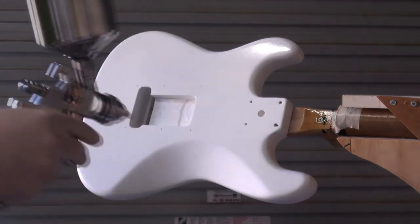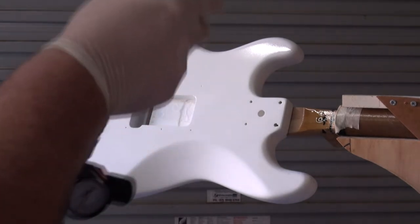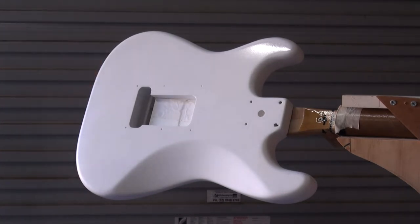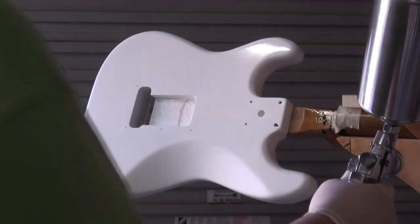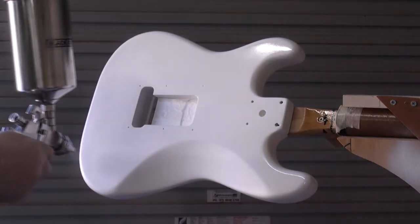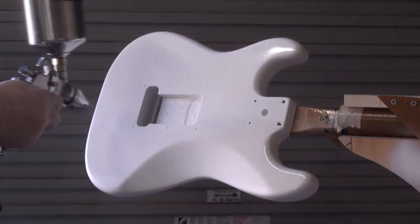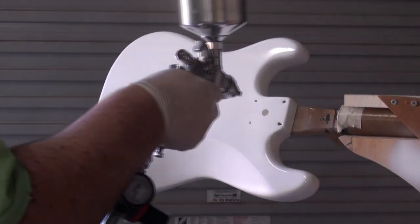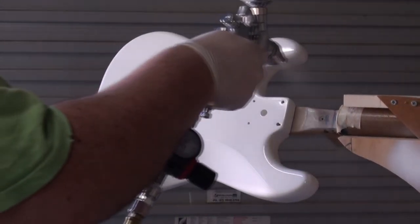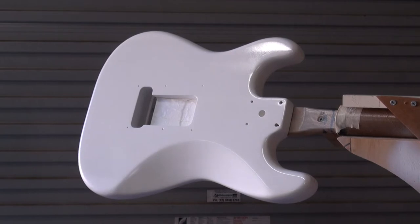I had already told myself to never use enamel paints again after my experience with enamel spray can paints on the spray can sunburst Squier Strat. However, I figured that by using a paint gun it would keep the layers thin, it would dry quite tough, and I wouldn't have the same problems that I did with the sunburst Squier project. I think this paint was better quality than what I had used from the spray cans on the sunburst project, because even though I'd laid it a little thick in some areas, it set quite firm and glossy, but did not become rubbery due to the thickness.